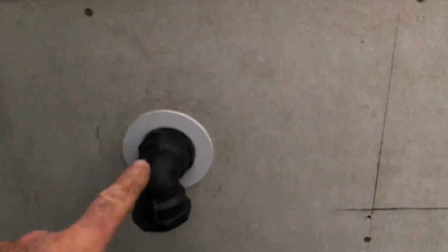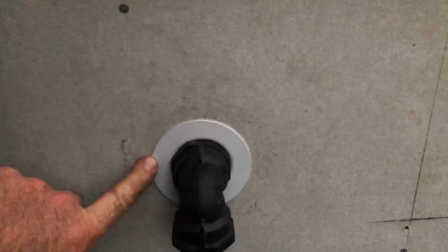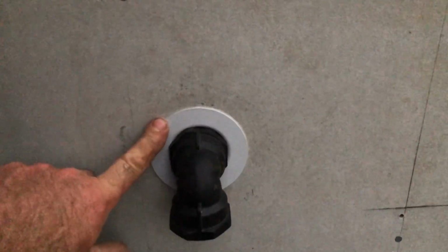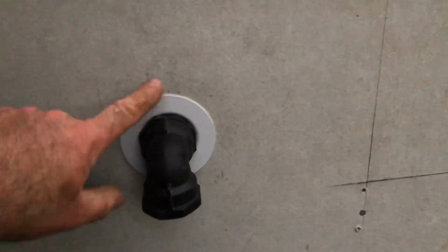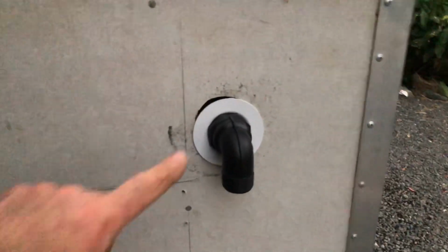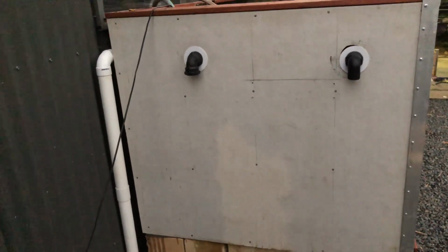That's what I did there. Looks fairly pretty. I had to cut through the FC sheeting with a larger hole to allow the bulkhead thread to come through, so that little toilet flange, or it's a 50mm DWV PVC pipe flange, looks quite nice and pretty there. I'll have to bog that up, and I was going to mount the filter just there, but it was just too big, so I've decided for simplicity I'm going to put a sump in. Righto, but for now I think I'm officially done because I've had enough.